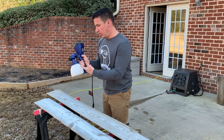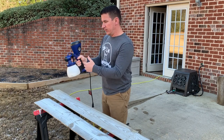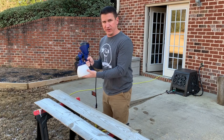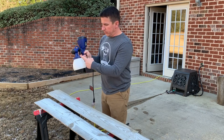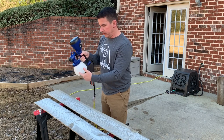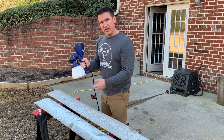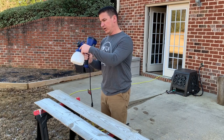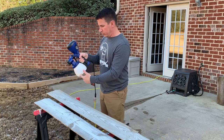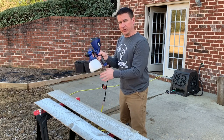The beauty of this sprayer is that all it needs is power to run. It's sucking in air through the filter in the back and then spraying out the front, picking up from the very bottom of the canister. I love that the nozzle goes straight down and angles towards the front so it's picking up from the front, because typically you're leaning forward to spray. If you do need to lean backwards you can always spin that nozzle to pick up from the back too. But I've got it pointing towards the front today so that it'll pick up the polycrylic a lot easier.